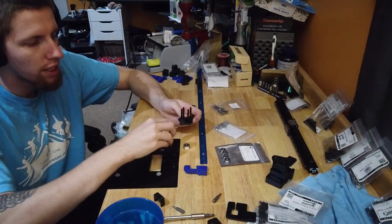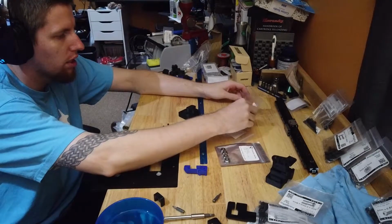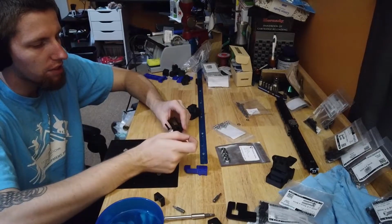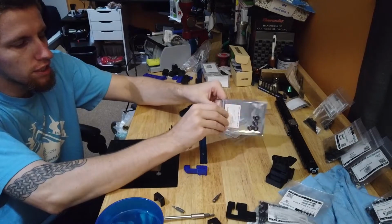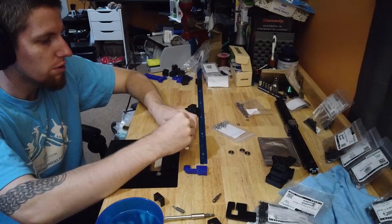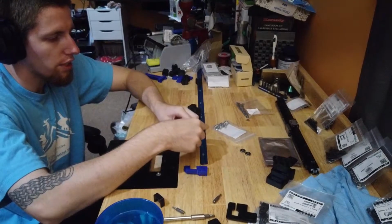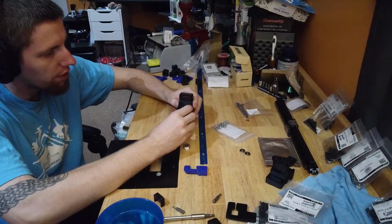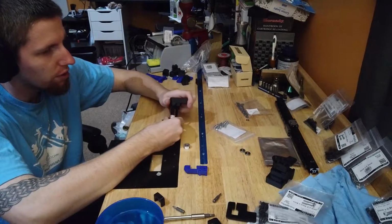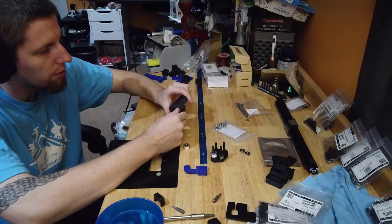looking at the diagram, the one with the step gets an idler. The one where the screw is just kind of sitting there gets a spacer. Two of these bearings in the usual fashion. Flanges to the outside. And another spacer. This whole assembly then goes down onto 3 nuts and a blind hole.